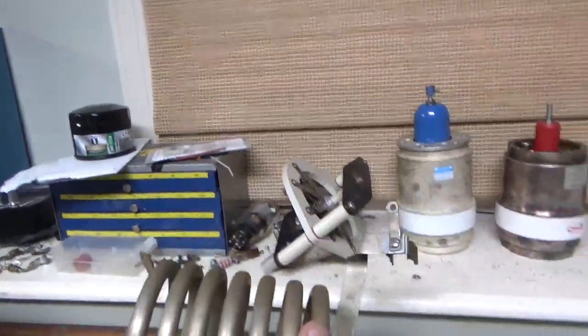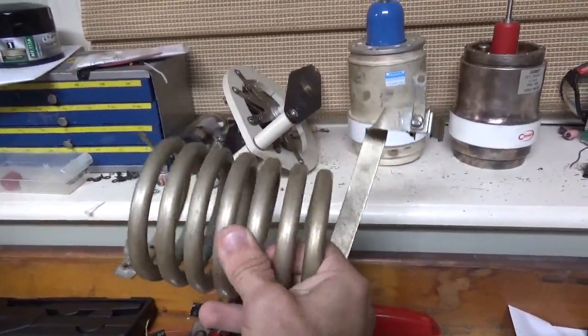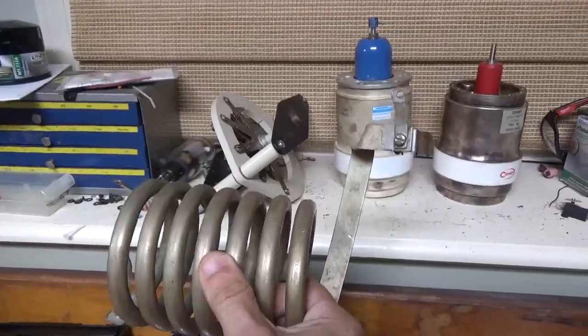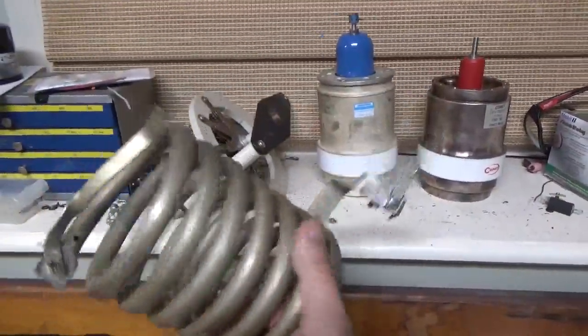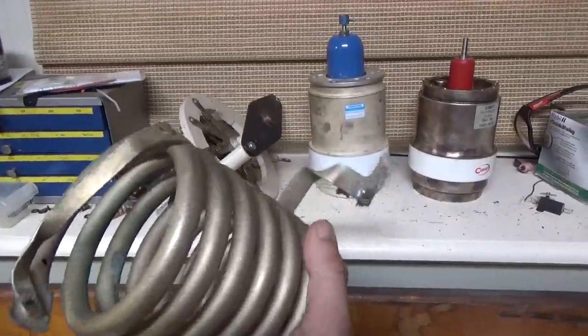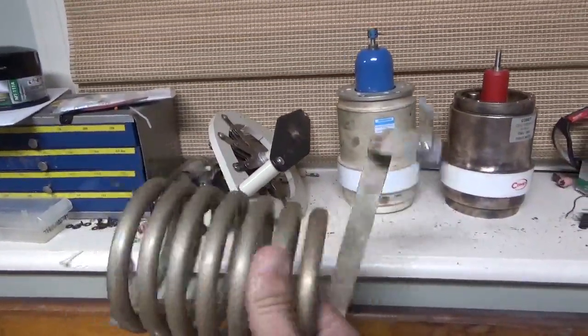For the higher frequencies I have a whole bunch of these coils, so I'm going to need some pre-inductance coils — and this gives me what I need. I ended up needing about 2.35 micro-Henrys. I'll take the straps off; I already have it. This material is hard to bend, so I already have like 10 or 15 of these and I'm going to use them.